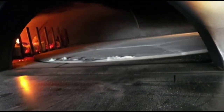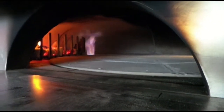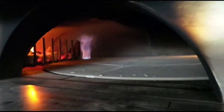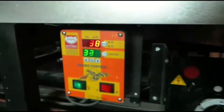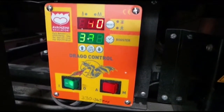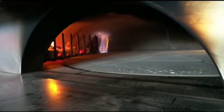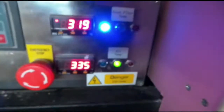The gas burner will automatically fire again at 338 degrees — here we go. The gas burner fires to maintain the oven temperature and integrity of the oven. You'll see this will skyrocket now. It's showing 331 with a green light, still going up. When it reaches 345, this burner will cut out.